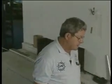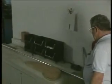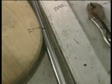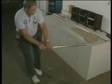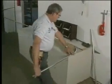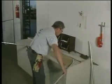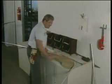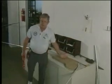To use the bender as a vise, what I'm going to do is put the tube into the bender, put the leg length on the leg length mark on the bender, and it's built right into the bender here. Turn the marks till they face my body, get out here at the end of the tubing and bring it around to about a right angle and let it spring back, keeping it level in that groove. Let it spring back, force it into the bender. If you put it into this groove and this backup, it'll hang there and it won't turn. So now it's a vise that won't goof up your tubing.